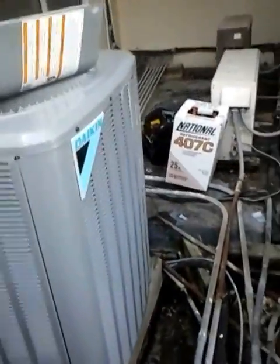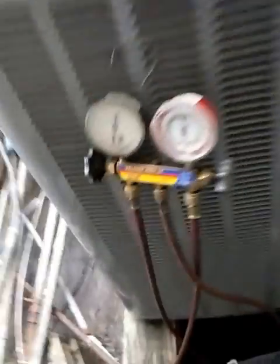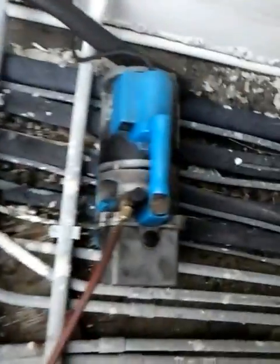Let me do another quick view around here — look at this graveyard. This vacuum has been running since 10 o'clock; I wrote it down. It's pushing 12 now, so we've got two hours in. This thing is about ready and good to go. I'll put a little black tape on the copper line, pretty that up, and get it shoved in there and close it up.